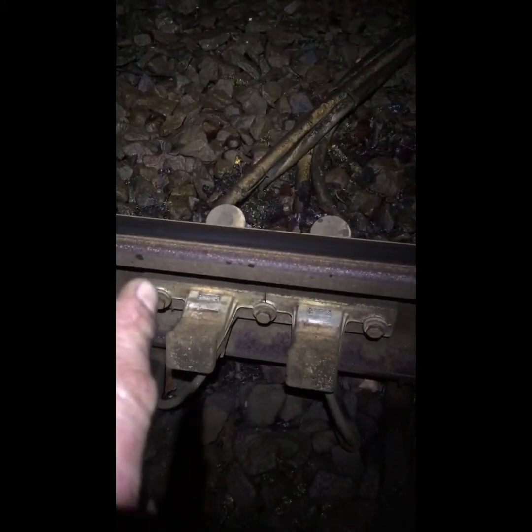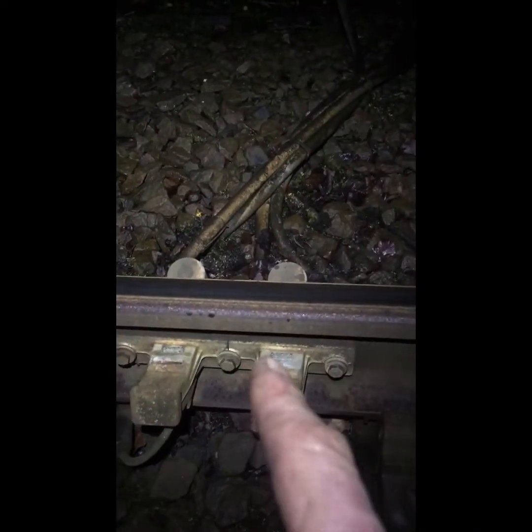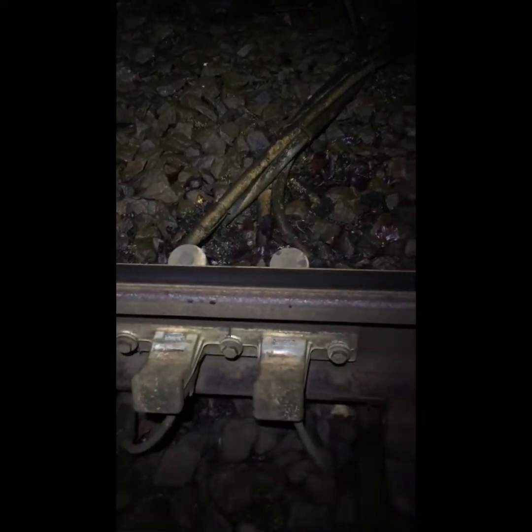This is one of our pair of counting heads out on the track. As you can appreciate, the train comes in from this side — this is SK1 head and this is SK2 head — so it will influence SK1, then move on to SK2, and the system will see that influence moving in that direction and count and register at the evaluator. The actual count heads are bolted through the rail, and then cables go off to what we call the mushroom, which is where the little electronic units are that generate the frequency, monitor the magnetic field being influenced, and then send that information back line-side by cables to the evaluator room at the office end.